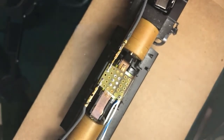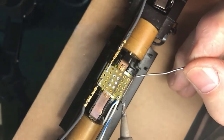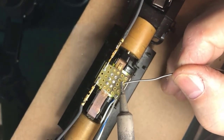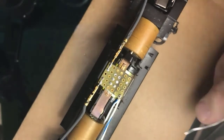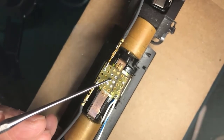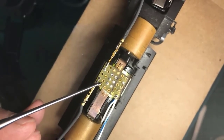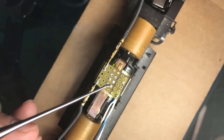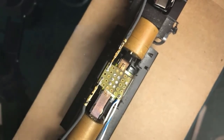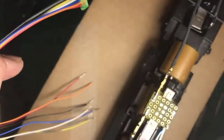And clean the tip. Remember, old solder on the tip is contaminated because it's been cooking. Come in, heat the work. All right, so now that wire is soldered into the circuit board. Now what we have is the top motor brush, the bottom motor brush, the rail on one side, and the rail on the other side, which means we can now connect the harness for the DCC decoder